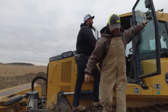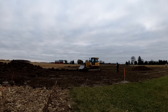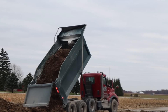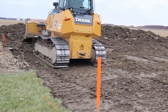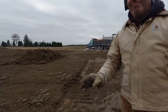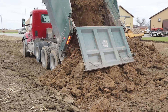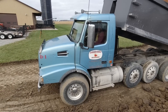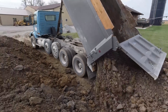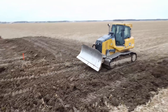Connor's much faster. When I pushed the topsoil off, we weren't quite sure what we were going to do with it, and we weren't sure about the upcoming weather either, so I just piled it up and shaped it into a mound so water would run off if it rained. But after Connor arrived and we shot grade and established a good plan, we knew we could use the topsoil around the perimeter of the building to get some nice drainage slope away from the building and back onto the field. Between loads, you can see Connor leveling out that mound I had so carefully piled up and shaped.